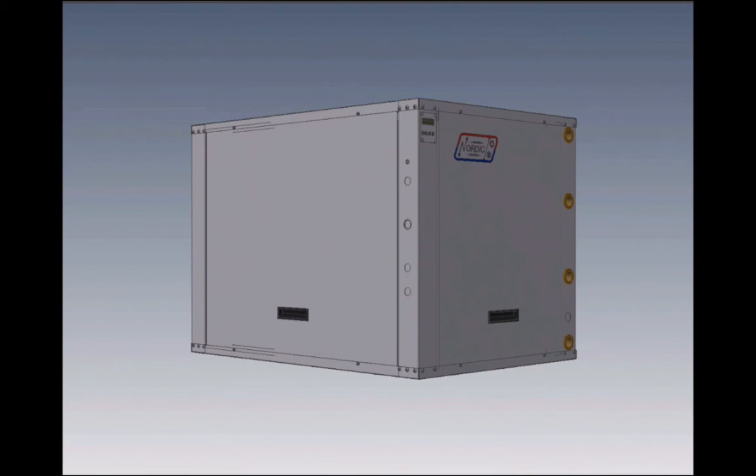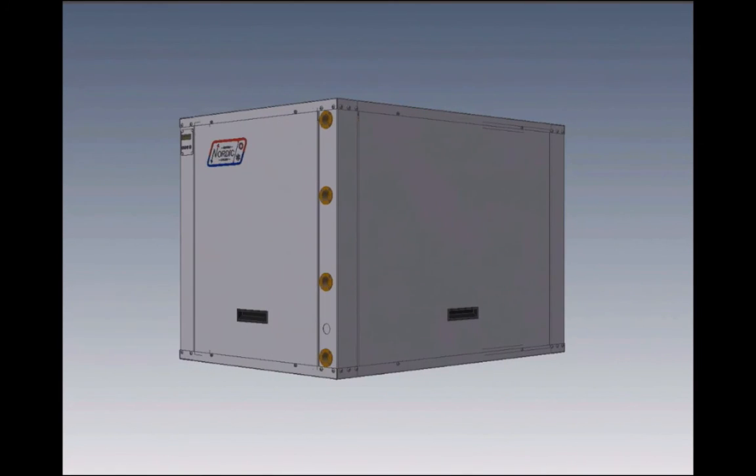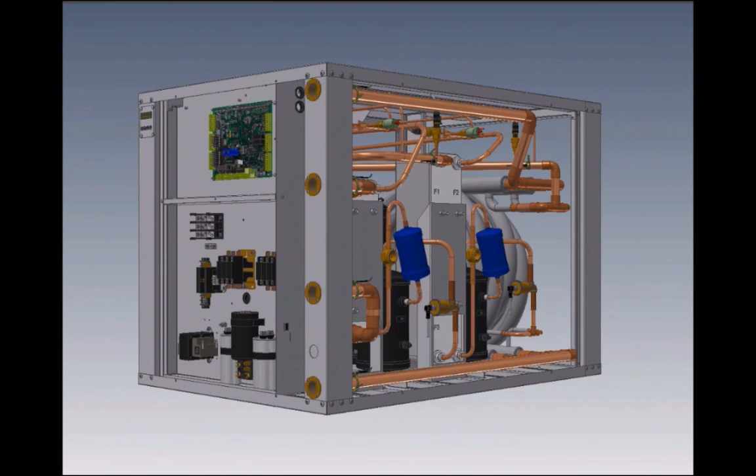The size 16 is an unusual size for us, but we've added that lower size because with a double-wall condenser, that's what would be required to heat domestic hot water in an average house — essentially doing the job of a domestic water tank. These units are non-reversing only and don't have desuperheaters. They use our Gen 2 electronic control board, which is used in several of our other new products. This board has a built-in aquastat functionality, so you don't need any external probes or thermostats to control the water temperature in the buffer tank.